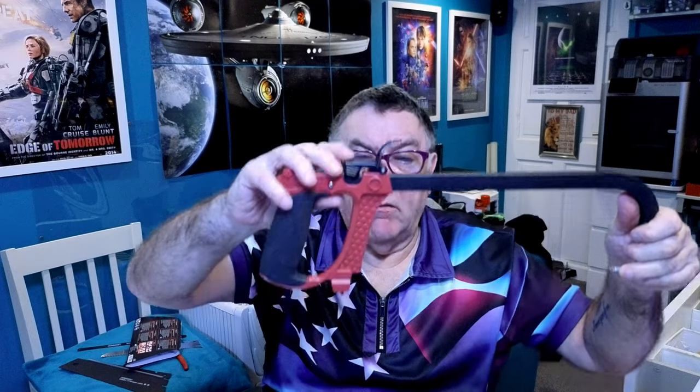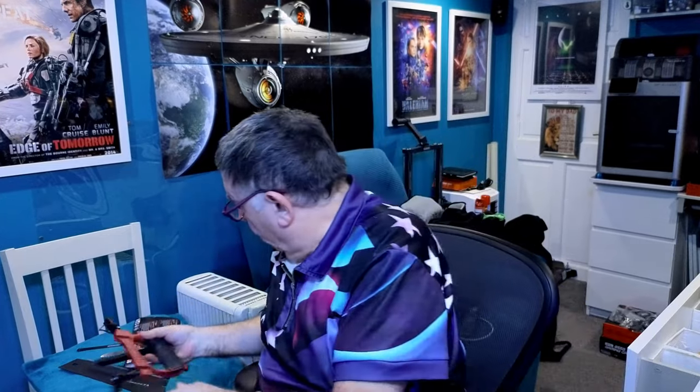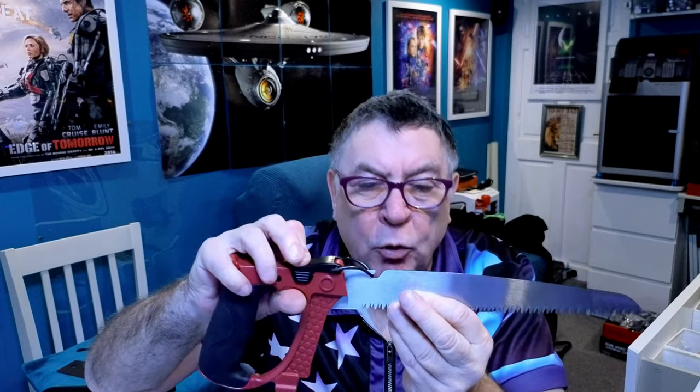So to change mode, you take this off, loosen that, take your hacksaw blade out. This lever here that goes in that dent, just swing that out of the way, and there's like a spring-loaded little ball there. You just push that in and you can totally take out the hacksaw frame bit. And for this type of blade, you put it in, there's a groove there, hole there, and this hook goes in. So push that in place, and then you put the hook down there. Pull it, and it spring locks on like a cam, and that is locked in solid.